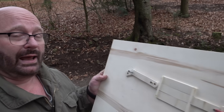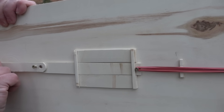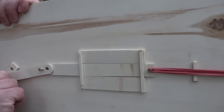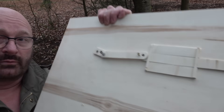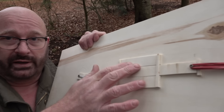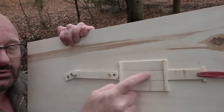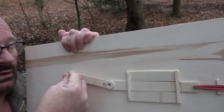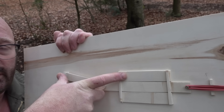Unfortunately, that is not our solution, because look what happens when I add more rubber — this now creates a lot of friction. You can even see how the piston is canting when I go up and down. This edge is pushing upwards and the other edge is pushing downwards. This kind of friction eats a ton of energy and we can't afford to lose energy, because energy lost in friction can't be used to cock back the bowstring. This happens because the piston wants to follow the vector force — it wants to follow the crank and form a straight line, therefore pushing upwards against the edge.